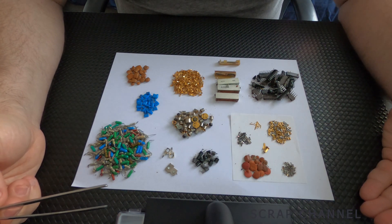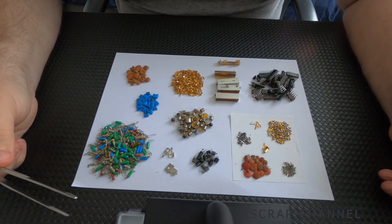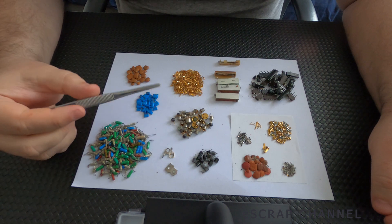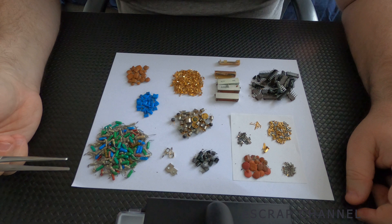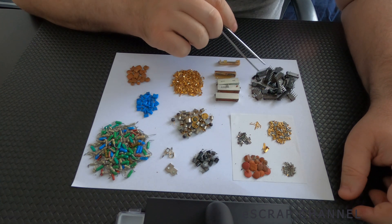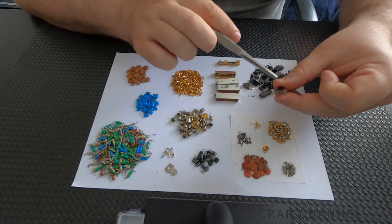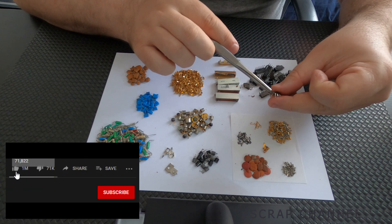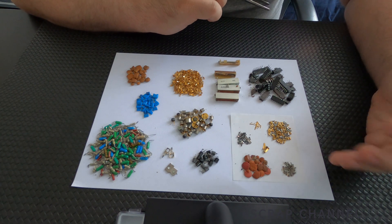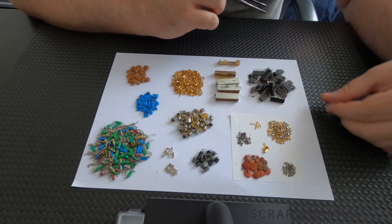Almost no value so far. In the middle, I put mostly transistors — they are magnetic. Most of them are small size, not Soviet Union ones, and not so much gold in them, to be honest. If I can recover 1-2 US dollars of gold from these transistors, it'll be fantastic. I also have these ICs. Most have no visible gold on their legs. You should break them like this — when you break the IC and you see gold plating inside, this is a good one. But from such ICs, even the best of this type, you will not get more than two and a half grams of gold per kilogram. Stockpile, keep them, process them when you reach kilograms. Nothing impressive.